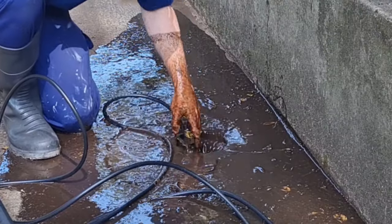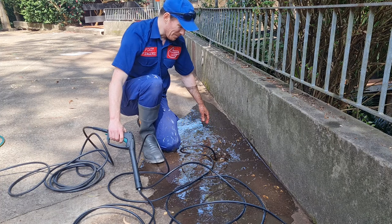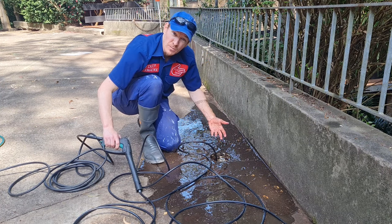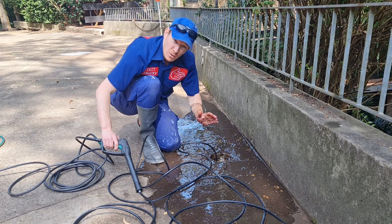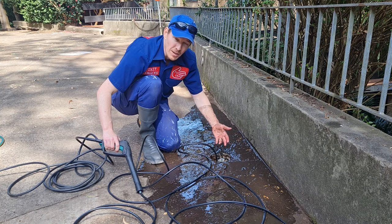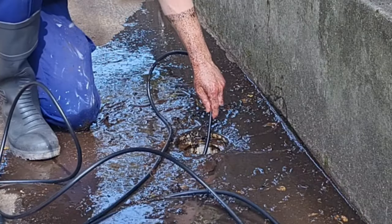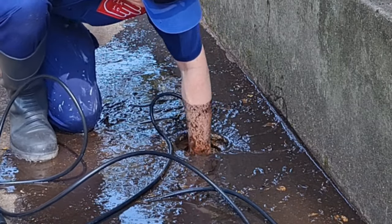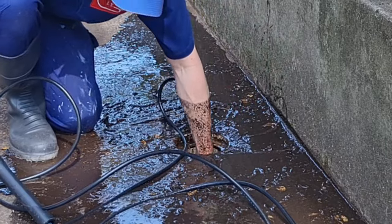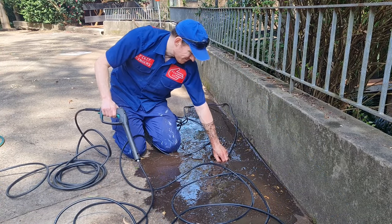I think the water's going backwards. Honestly, I didn't think that was going to work, but I think we're good. A little bit of a clean out, then we'll switch to that proper head and we'll feed it through and wash it properly. That front forward jet is what's really done the pressure work. Now I will say there are no roots in here — this will not cut through roots. If you've got the old school ceramic pipes and they're cracked and got trees in there, you need the plumber and the reliner. But for relatively new pipes, it's done the trick. It saved me a couple of hundred bucks. One thing I will mention: with those backward-facing jets, once you've cleared out all of the gunk, it really does want to pull your hose deeper into the hole. At the end of this there's even a super tight junction and I penetrated that at some stage — it was difficult to get the shaft back out again. No worries though — release the pressure and I could make a safe withdrawal. Scary moment though, I thought I'd be trapped in there for a second.